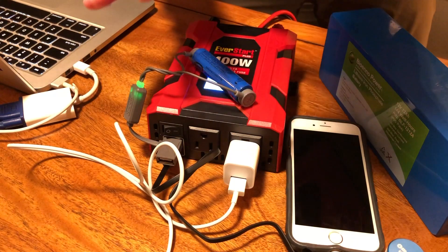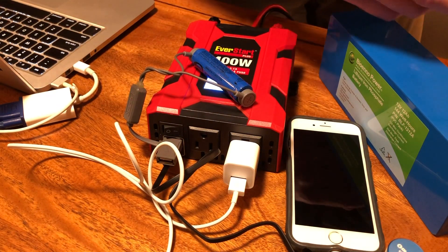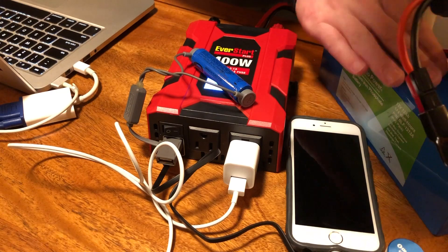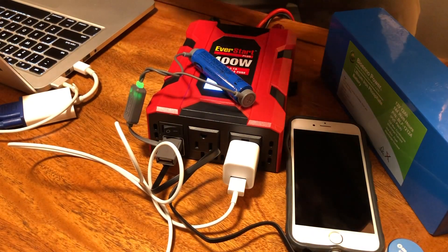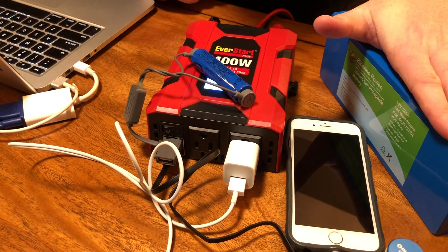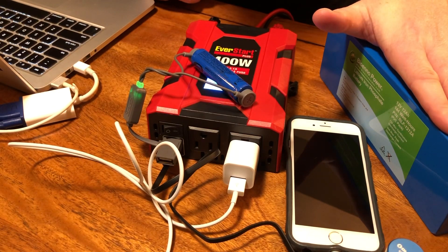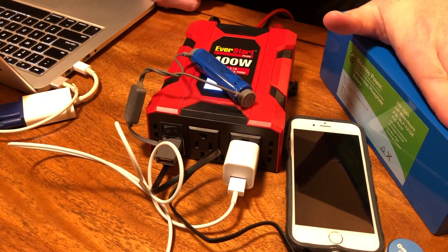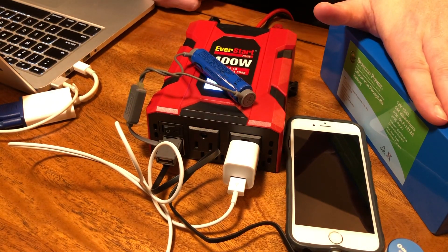So this is a very powerful system. Even with everything connected and charging, we're using very low amps. Something with 12 amp hour capacity will power and recharge these devices many, many times. 12 amp hours means if you theoretically pull 12 amps continuous for one hour, that's the capacity — or you can think of it as one amp continuous for 12 hours. Since these devices are pulling about half an amp, you could continuously discharge this battery for about 24 hours.